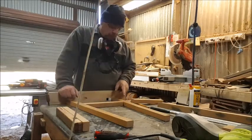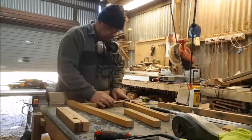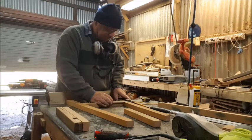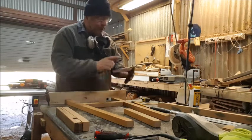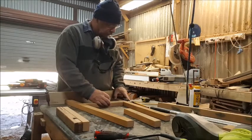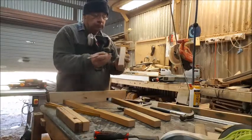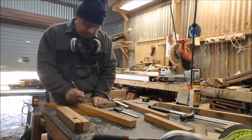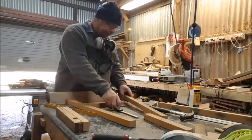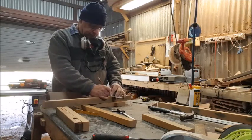Now what we've got to do is measure where we're going to put the screw holes. Do you get your bevel? And you get your angle of your dangle? I'm rude, I know. Right, so you've got your angle and your dangle, beautiful, not a problem at all. So now that angle there, when you put it on here, it's going to be dead on, straight into that piece of timber. I'm using the Bushman's ruler, which is usually pretty good. And what I do as well is I mark them. So this is 2, and that's 2, this is 1, and that's 1. Always mark them. That way you know they're going to go together in the right bloody direction. Trust me, when I first started doing this, I stuffed up.